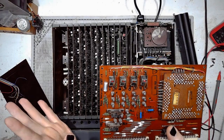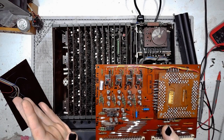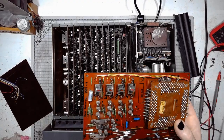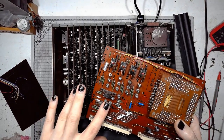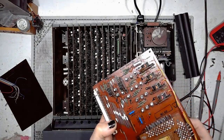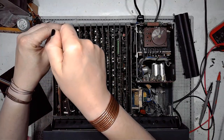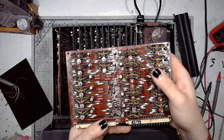I won't explain the exact principle of operation of the ferrite core memory because there have been lots of videos on the subject already. But I will explain how this ferrite core memory is addressed and controlled. There are also two additional circuits on this board. They control the inhibit lines on two of the four layers of the ferrite core memory. The remaining inhibit controls are located on the second board, together with all other addressing controls for the core memory.